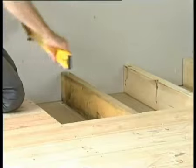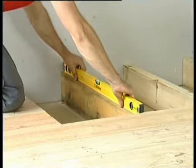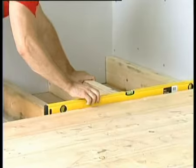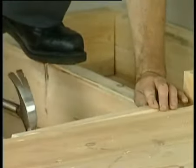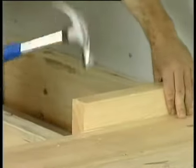The floorboards can now be removed to accommodate the Wickes deck. The Wickes deck should always be fitted perfectly level on all four sides. Check the top of the joists are level and adjust if necessary — the performance of the deck is determined by this accuracy. It is important to secure the Wickes deck on all four sides with noggins to limit the amount of movement in the floor. They will also act as fixing points later on in the installation.